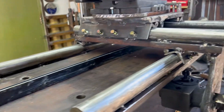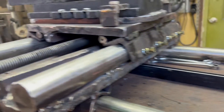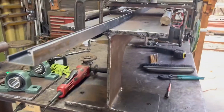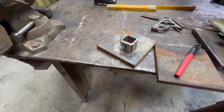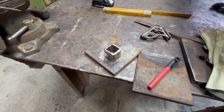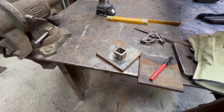Now I'm going to take this plate off and scribe a centerline right down the middle of the deck to help me align the bearings. I plumbed up from the center of the web, put a mark on both ends, clamped this aluminum straight edge — which is really straight — and scratched a mark all the way down it. Then I put the plate back and bolted it down. I'm getting ready to make my tool holder — three-and-a-half inches square — and cut the shim stock with the grinder to get them straighter than I could with the plasma torch.